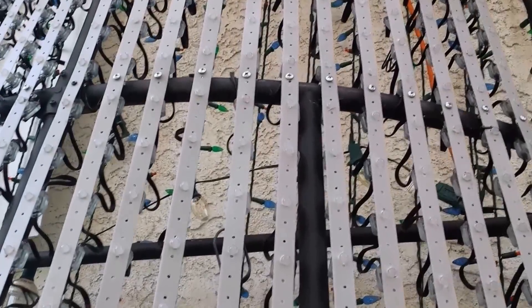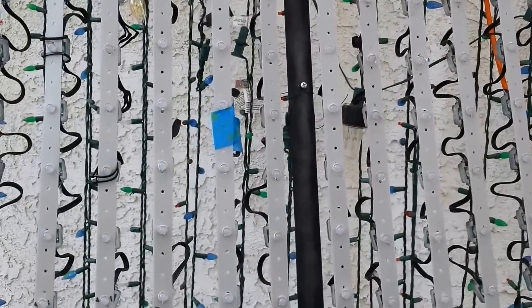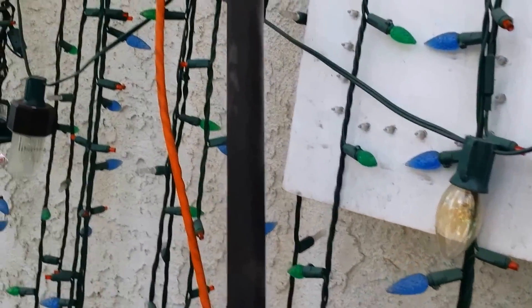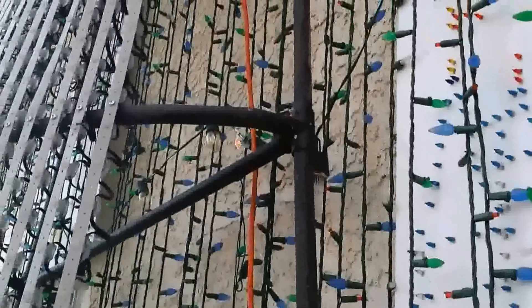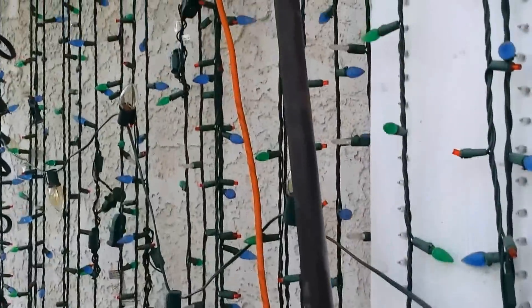Because there was a little bending since it's PVC, I stuck an extra piece in here just to give it some support. In my other video you'll see that inside these PVC pipes I actually put conduit to make them nice and rigid. A 10-foot piece of conduit goes the full length, there are pieces of conduit that go across horizontally in multiple places, and there's a piece that goes across the very top — all just to give it rigidness. That made it pretty sturdy and strong.